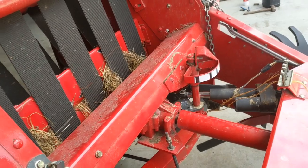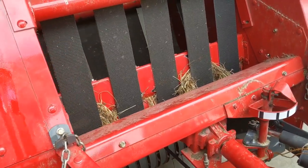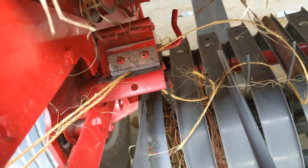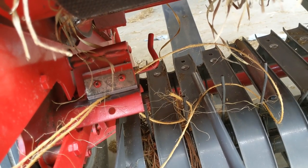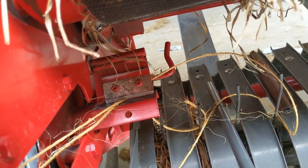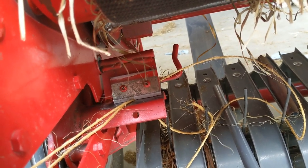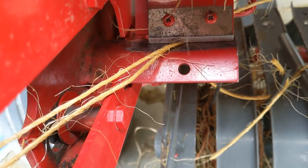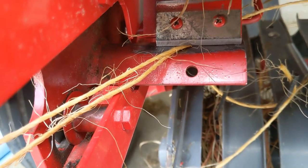Still on the 1734 — we've been battling it for two hours. The issue is the knife. We have it now sharp and on correctly. It actually was not put on correctly — I've seen this twice now. I looked in the book and in some pictures they have it on backwards, some correctly. It's fixed. We took a file and had to clean all the paint off the anvil — that bottom part is the anvil — and rough that up so the thread grips good.